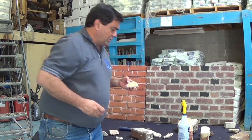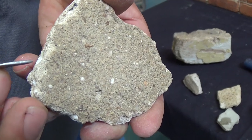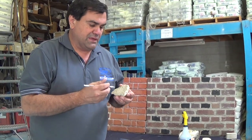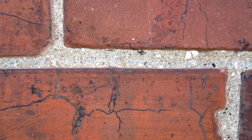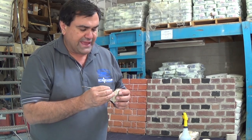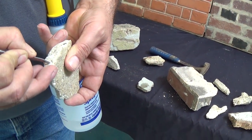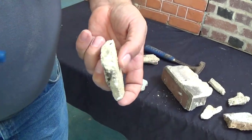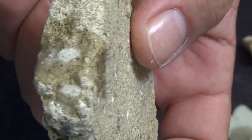A third test: when examining historic mortar, you may see small white inclusions called lime blebs — not fully slaked chunks of lime. These come from a 'hot mix,' where sand was added directly to calcium oxide on the job site, slaked together, and the mortar used while still hot. If you see white inclusions, use a small tool to shave at the piece — if it carves away almost like chalk, that confirms it is a lime mortar. Spraying vinegar on those lime blebs will also cause very strong fizzing at that spot.